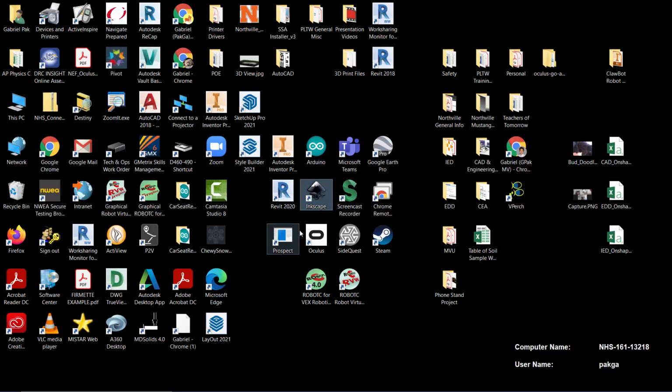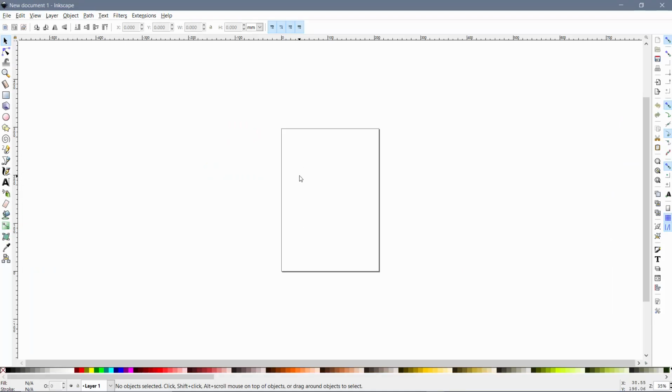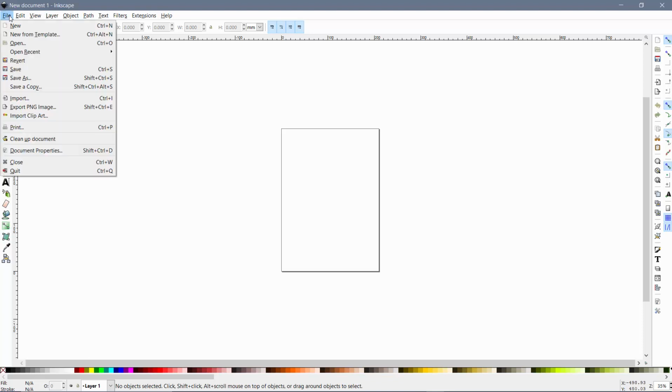I will have it up there shortly on the virtual machines as well. Okay, so as this loads up, this is what we call a vector file. The idea of a vector file is essentially just really clean lines, so that when you send it to the laser cutter, it's able to follow that line. If you've ever seen a laser cutter work, it's just going to follow. You can essentially set two settings, either a cutting setting or an engraving setting. When it's cutting, it's going to follow that vector line and cut out exactly the line that we want, which is pretty much all we're going to do for ours. You can also set it up as engraving, and engraving allows it to change the speeds and the power level, so it's just kind of burning the surface of it, and that's how you get some of those fancy designs.